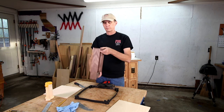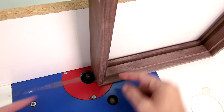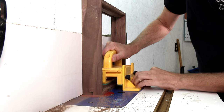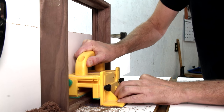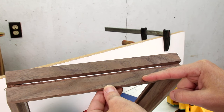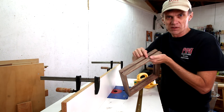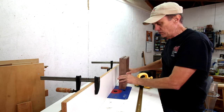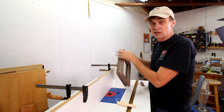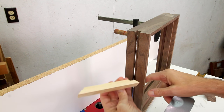Now I can separate the lid from the rest of the box. I've added an extra tall fence to my router to support it, and I've adjusted the fence so that the router bit is going to cut through just below this groove in the top of the box, right along here. You can see light through the other side and how that's just barely cut through, separating the top from the bottom. The higher I raise the bit the looser the lid is going to fit onto the box, so I'm trying to keep that gap as small as possible to give it a fairly snug fit. I'm going to flip it over and do the opposite side. When I go to cut the final side it's likely that these two pieces are just going to collapse in on each other, so I want to keep those separated. These spacers should provide support.